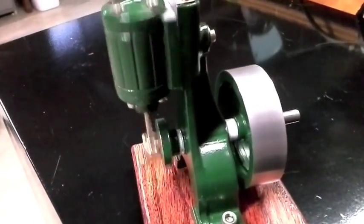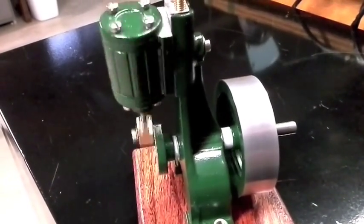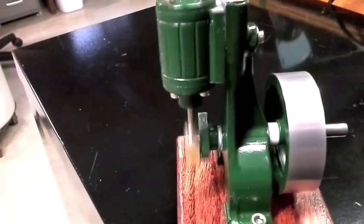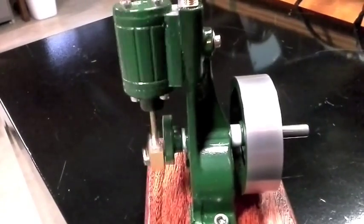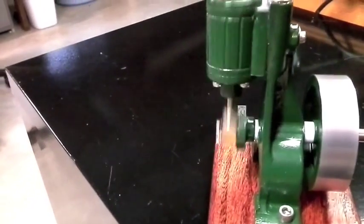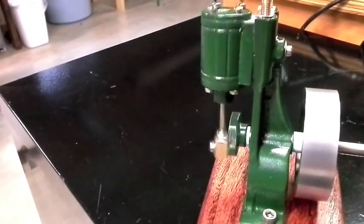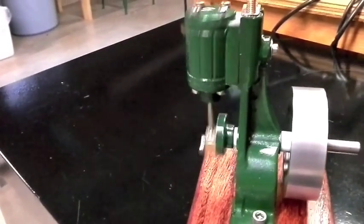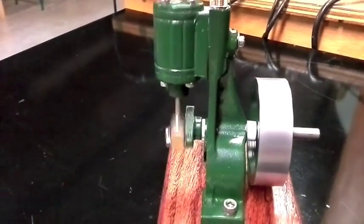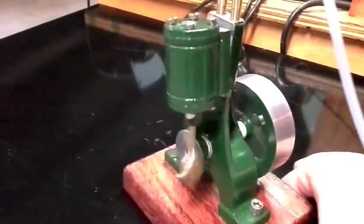You can see here too, as an addition that didn't come with the kit but I added on later because I wanted it — I put some nice Teflon bushings in there, because originally all it had to keep the shaft from sliding back and forth was whatever blade was there on the crank end. That worked well enough, but I decided I wanted something a little more solid in there to keep it from sliding back and forth too much.